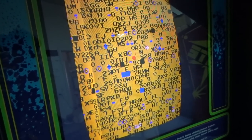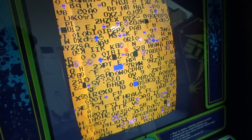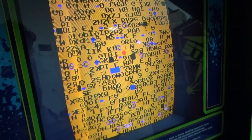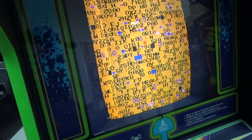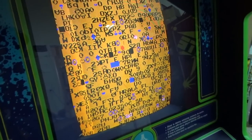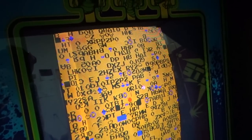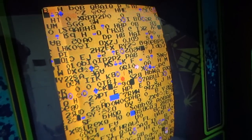And also, the clock is used to make the sync signal, which syncs the video to the screen. Since it's all stable and not rolling or anything, that part of the clock's definitely working. Since you've got sync and it's static on the screen, most of your clock, at least, is working. So we've probably got that, but we've got some kind of issue where it's not able to access half of the stuff, or we've got a whole bunch of RAM chips that are bad or something.